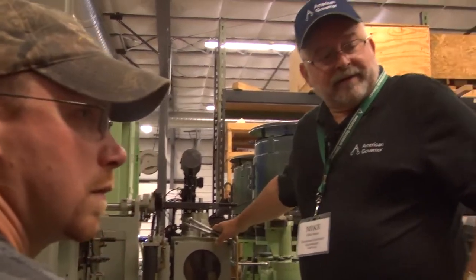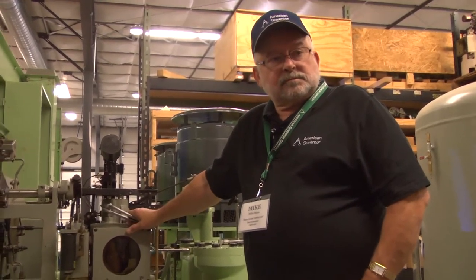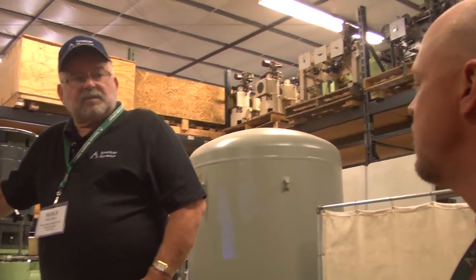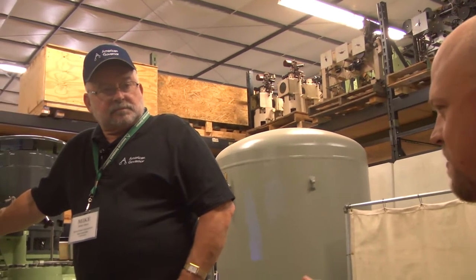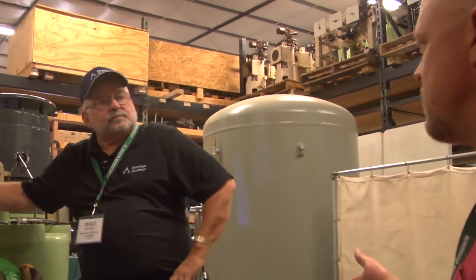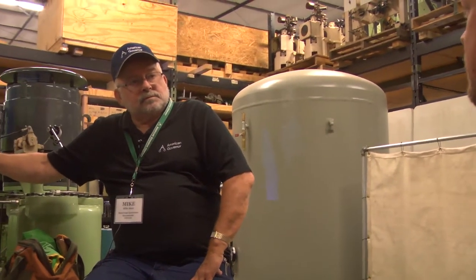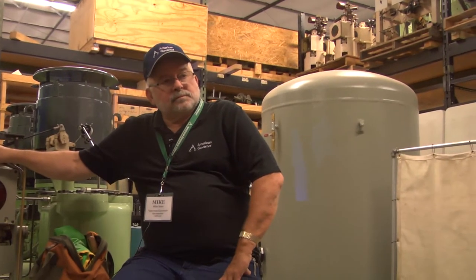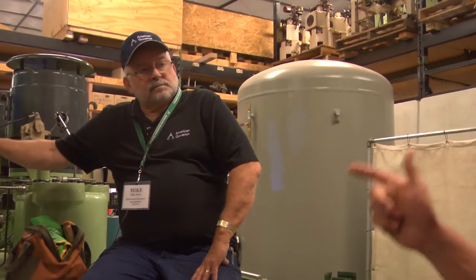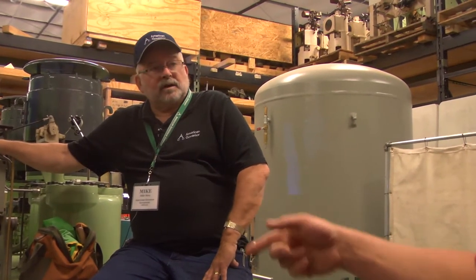We had one time, we have nitrogen closure. If we overspeed or lose power at the plant, we have nitrogen tanks, and they charge the line, and there's a valve there that closes, to make sure it closes again. I was talking to an operator, really smart guy, knew his stuff. He was a mechanic, and then he ended up being an operator. He said, hey, you need to put a cap on that fitting right there, it'll just run out if you don't. So I screwed that cap on, and I went to try and fire the unit, and it would not come on because it pressurized the nitrogen and closed my valve. Shut it. So I couldn't move it.